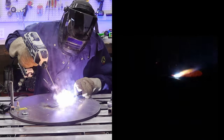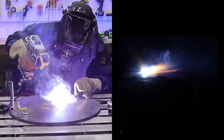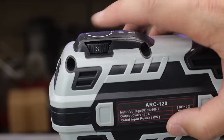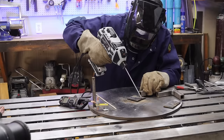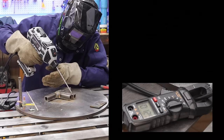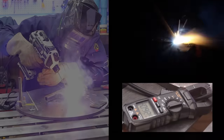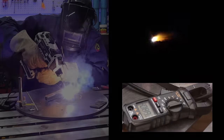I had a really hard time starting that 3/32 inch rod, especially since it was 7018, which you typically run a little hotter. I bumped it up to about three and a half and was able to just barely get the weld going. 3/32 inch 7018 did a lot better on the number four setting. The last test was the eighth-inch rod — I maxed out the machine at the five-and-a-half setting and couldn't get it to strike. I noticed the actual amperage is a lot lower than what they claim — it does not get close to 120 amps. So to test at max, I tried a new 3/32 inch rod and it worked just great.